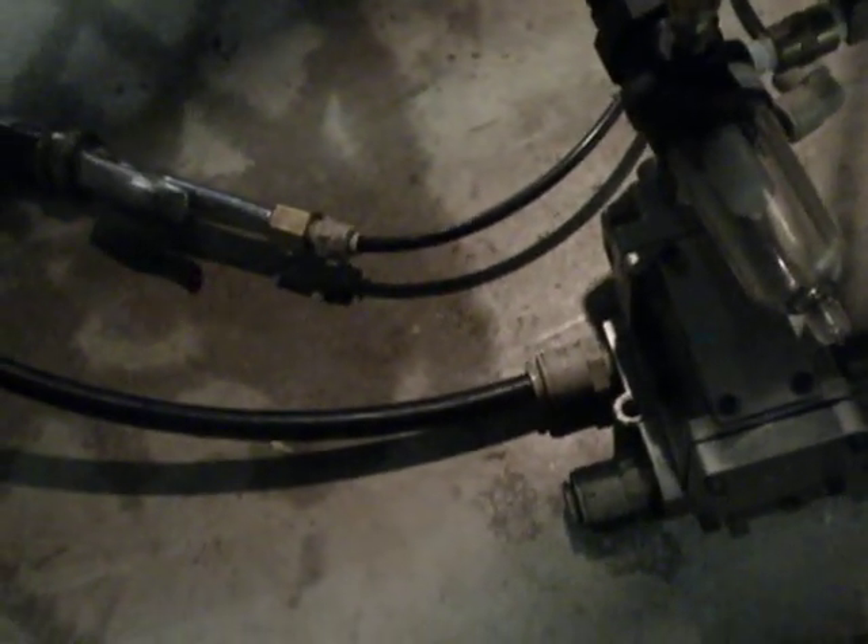When I engage the air pressure, air comes through. It takes some of it off and supplies air to this. It also supplies air to the pilot. And when you activate it, it sends air pressure out through this line, pushes on the air pack, and pushes the piston forward. When you let off, the air bleeds off the pilot, it shifts back, and the air is bled out through the exhaust.